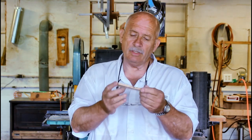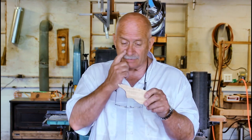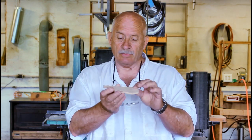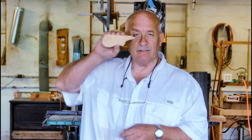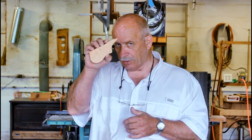It's got those two pieces of glued together wood, and this back piece, as well as the front piece, was just simply sanded off or sawed off on the bandsaw. So they're wavy and they're rough, and I mated the two gluing surfaces, but only that. So I'm going to take the outside, the part that you're going to be seeing, which is really, really pretty, and I'm going to level it off and thickness it down just a little bit on the belt sander.